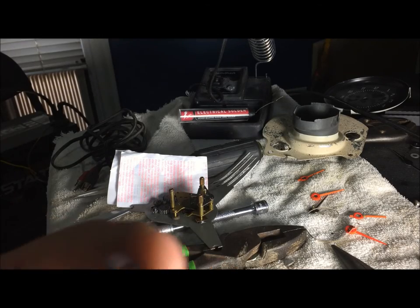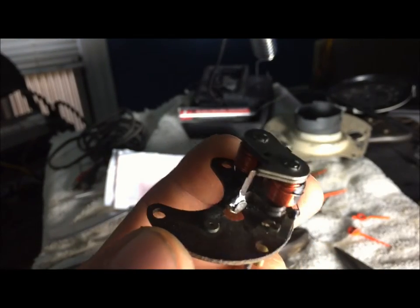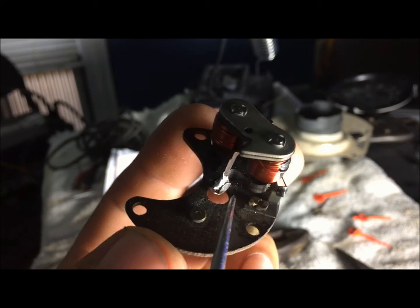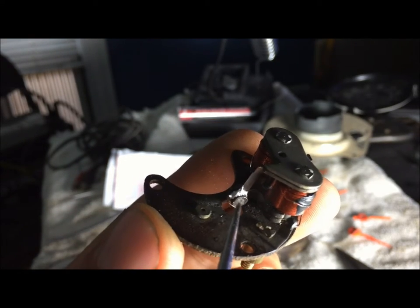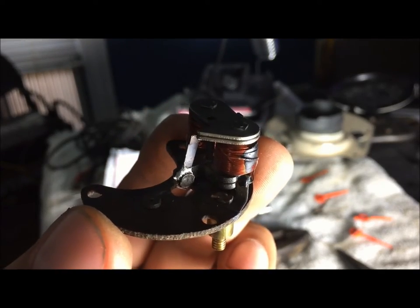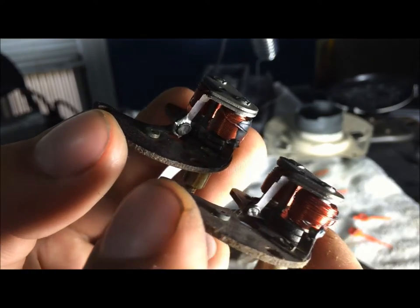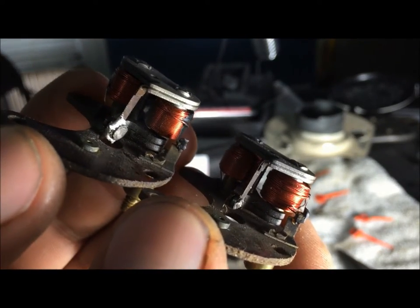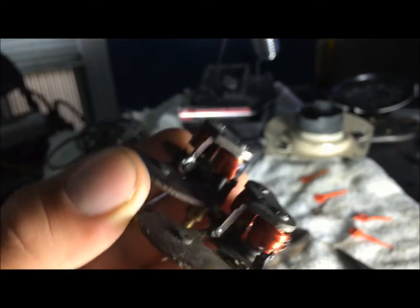The other side of this is the hard one — this is really the hard one. I took one of the point contacts and it was already corroded a little bit. You cannot pull this out — this is where you're going to have to solder it. You can see it's got a bigger contact now. The factory one hasn't been touched — you can see it's warped, it's like melted halfway. So that's what happens to these clocks: it's these contacts.